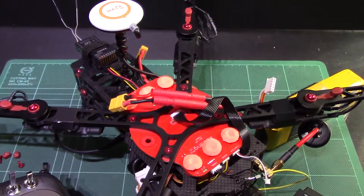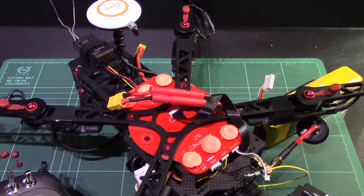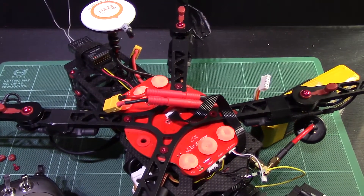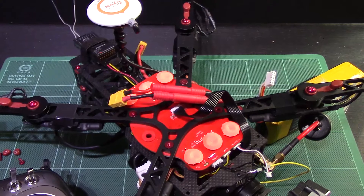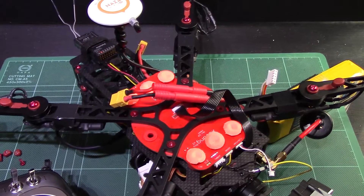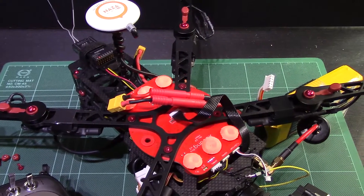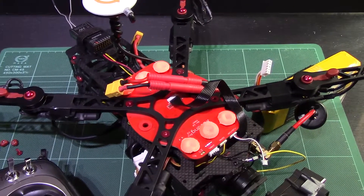There are two methods to fix this. One that doesn't involve any wiring changes is to simply buy something like a FrSky SBUS-to-PPM converter. It adds a bit of weight and costs a little more, but it's a proven concept and will give you full PPM functionality.